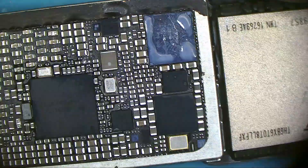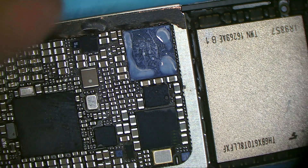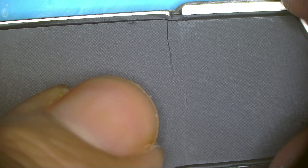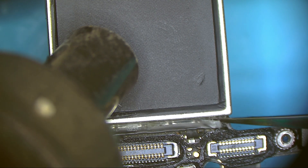The board looks very clean, at least from one side. I can see that someone already reflowed the audio chip, because there is a common fault in the iPhone 7 where the trace under the audio chip tends to get broken, leading to boot loops, lagging touch, and audio problems like the microphone or loudspeaker not working. Because of the reflow temperature applied here, and because just under this codec chip on the other side there is a baseband chip, maybe the technician spent too much time reflowing and the balls underneath the baseband chip disconnected or shorted.